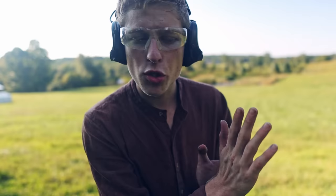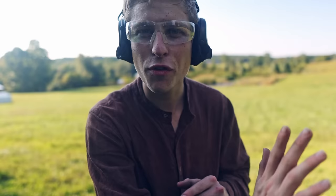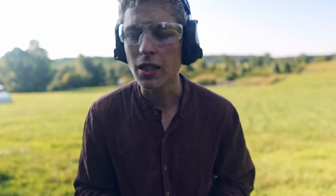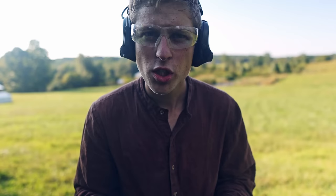It actually kind of chokes over its own brass because the brass is deflected straight forward back into the gun. No good. So I definitely need to look into the geometry of the deflector. This is a problem I've been struggling with the last few iterations, and I think that my bolt carrier group having something wrong with it definitely is a factor, but I think that the printed upper's geometry is somehow off just a little bit, causing the problem. So I need to investigate both of those. However, with the Aero Precision bolt carrier group, it seems to be functioning quite well, so let's keep shooting.